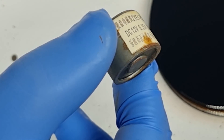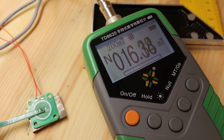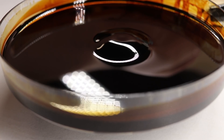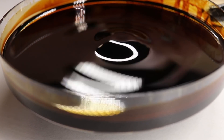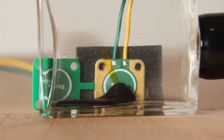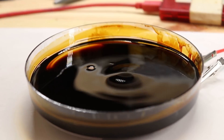Let's forget the magnet biasing idea for now and see how this compares to an off-the-shelf electromagnet. The off-the-shelf electromagnets create a much larger bubble — at 5 volts they generate a magnetic field of around 20 millitesla, which isn't that much larger than my 12-layer PCB electromagnet. But these can be powered with 12 volts, making them much more powerful. I tried powering my coil with 12 volts and the magnetic field pumped up to 30 millitesla, creating a much stronger bubble. The heat is a problem at 12 volts continuous, but Simi created a music visualizer that supplies short pulses of 12 volts, which kept the coil at low temperatures. These are some 12-volt PWM tests I've made, excluding the magnet biasing.